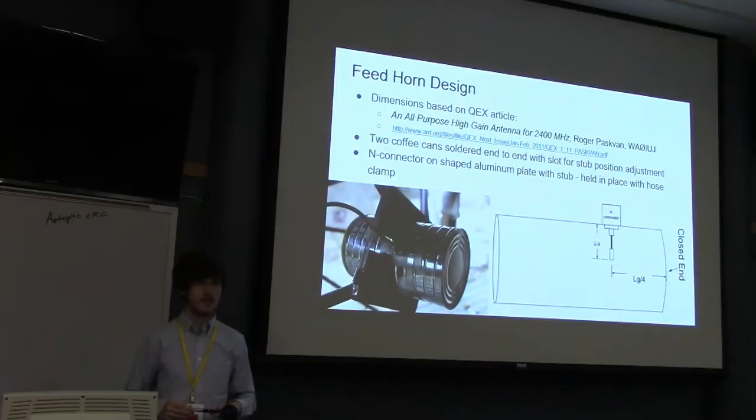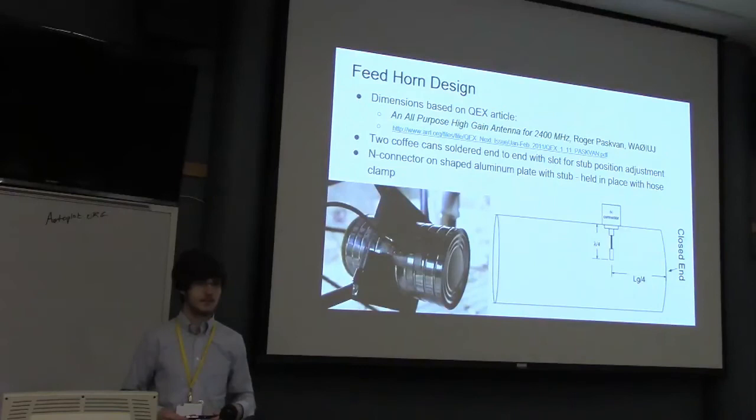It's going the right way. It looks fine. And I noticed that the probe is fat on the end because it needs that. The reason is it reduces the SWR of the system, the can, the whole cylindrical waveguide, it makes it perform better. That's another benefit, a little tweak. They're not really worried about the bandwidth. What they're really worried about is just getting a good VSWR notch, because any energy that's reflected in the system is energy that's not delivered to the preamp. So you want to stop the reflection. If you have a dB of loss because of bad VSWR, that's another dB on your noise temperature. It adds directly to your system noise temperature, so you want to avoid that.